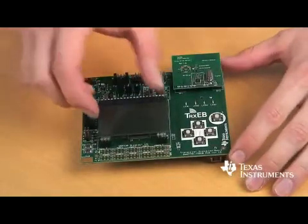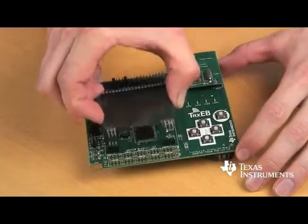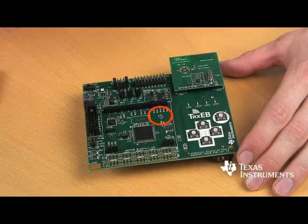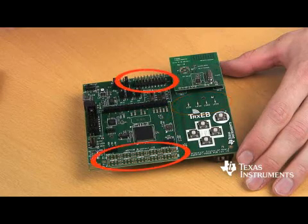So looking at these evaluation boards, what peripherals do I have when I do application development? The board is developed to make it very easy to make demo and prototype software. The board has a large LCD screen, it has an accelerometer for movement sensing, a light sensor, an external SPI flash, LEDs, buttons, and of course breakout headers for easy connectivity of other peripherals.